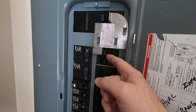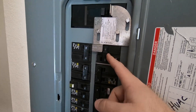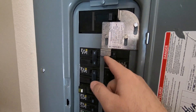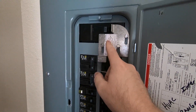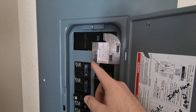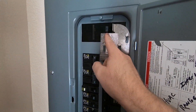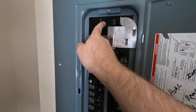It's got your typical four-prong there. Basically what you do is start your generator outside the house. I like to put mine at a minimum of 10 feet away from any house, open window, or anything. You start your generator up, let it run for just a little bit, plug in your four-prong 240 into the generator, and put the other end into this hole right here. This in turn is powered by this interlock generator breaker. So once this is on, that system works.